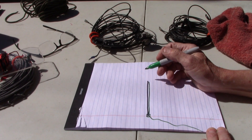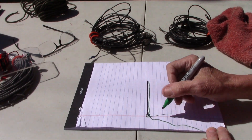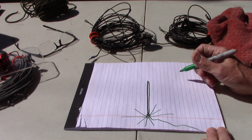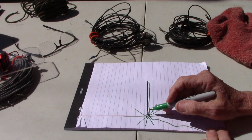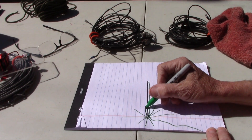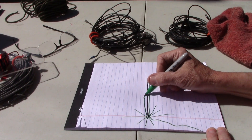It works really great — you don't have to fold it over or anything. Just run your radial field. You're going to put radials out; more the better on radials. If you've got a center connector, you don't have to stick to just one element. When I take this antenna out myself, I put one up at 40 and one at 20, right there, and tie it off.